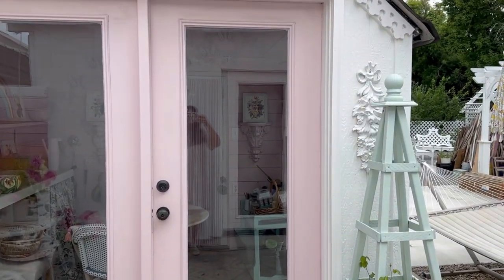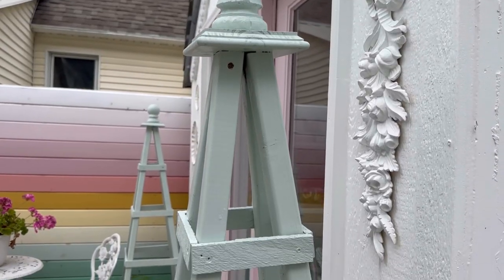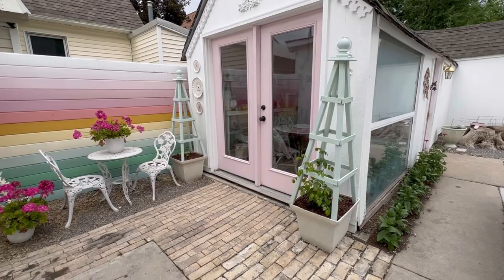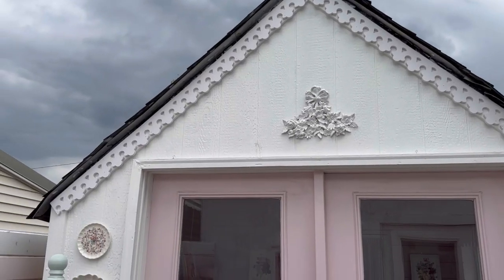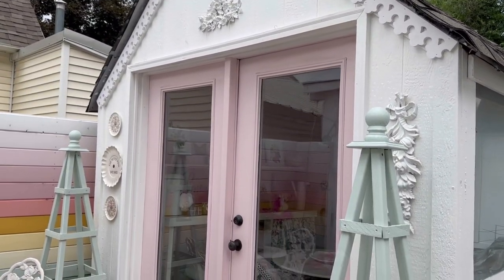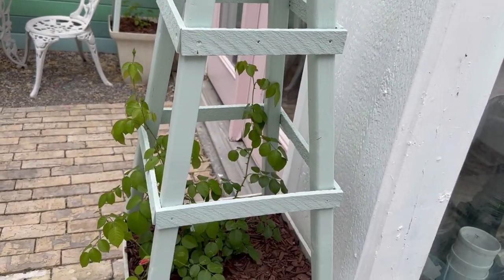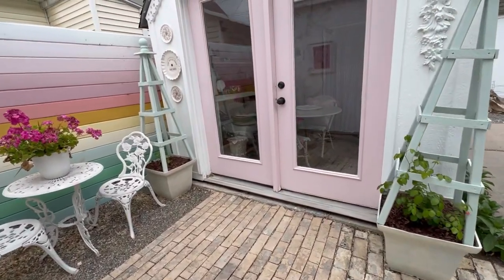I'm really happy this was a simple project. We didn't do any angled cuts because of how we screwed the top frame together and then just sanded it flat — you could even use a handsaw, that's how easy it is. Mine is four feet tall finished height plus the height of the planter, and you could build it without the planter and just put it in your garden if you want something shorter. It works great for climbing roses, clematis, morning glory, and it could work for vegetables too — squash, tomatoes, sweet peas. It uses a lot of vertical space, which draws your eye up and really elevates the look. I hope you like this project — let me know what you think in the comments, and if you did like it please give it a thumbs up.